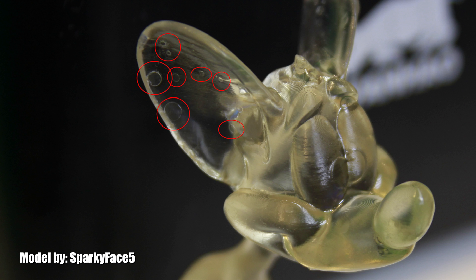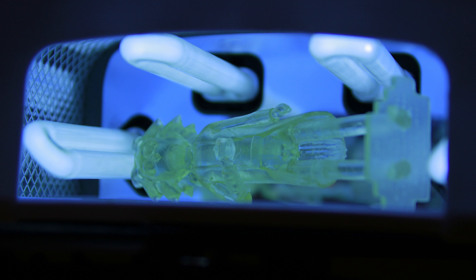Once the model is cured and finished, it does print upside down as you can see behind me. You use the plastic spatula provided to scrape it off the build platform. You then need to do post-processing, which is not necessarily required for FDM printing. You need to give it a swirl in isopropyl alcohol to remove any uncured resin off the print, otherwise you'll get blobs of uncured resin — like drips — which will cure into the model. Then you put it out in the sun to let the UV harden the model, or you can cheat like I did and use a nail salon UV lamp — just put the models in there for 10 minutes and job done.